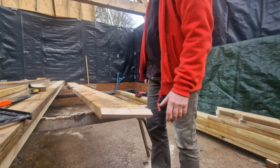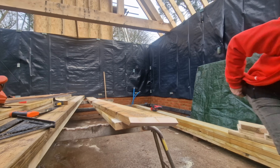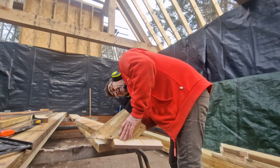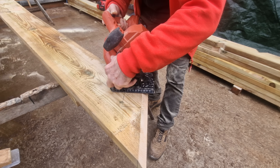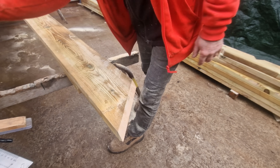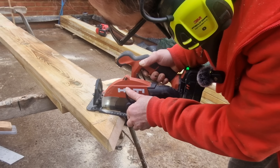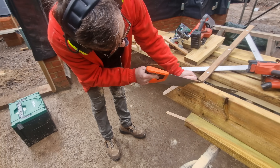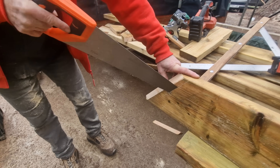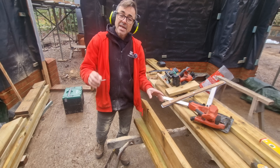Now we've got to cut out for the pole plate, which is in the same direction as the bottom. To do that, I'm going to imagine this is the pole plate — just to get the right thickness of it I'll lay it on like this and mark the back here. Right, so that is one hip prepared. It's a bit bamboozling, but we'll take it up, try it in, and repeat that process — get all of those in and get all the jacks in.